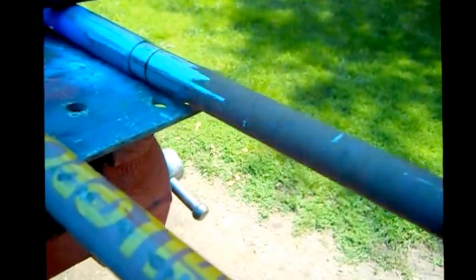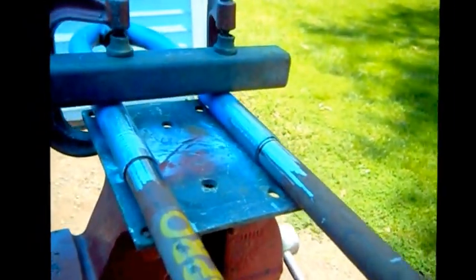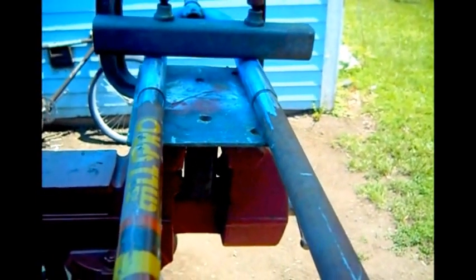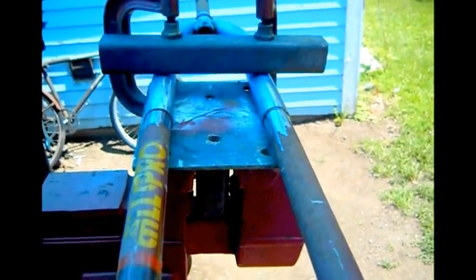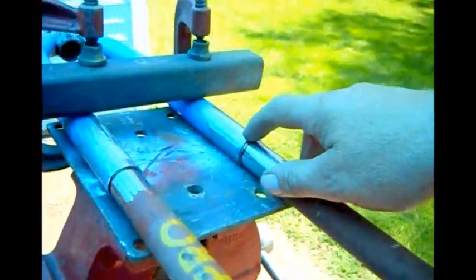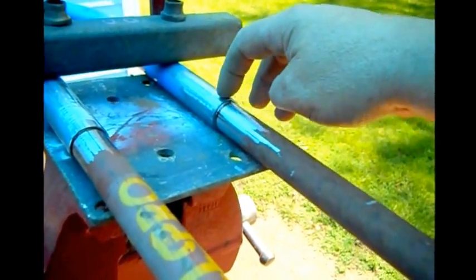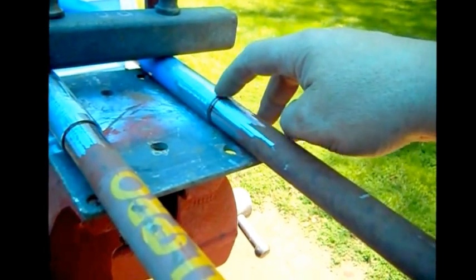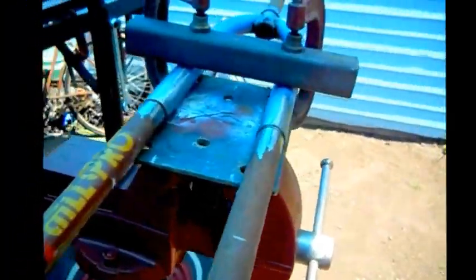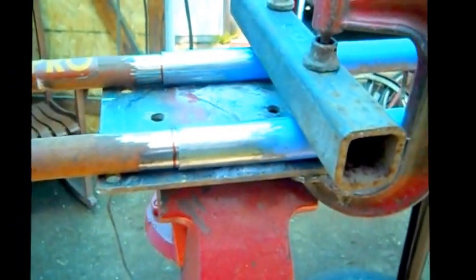These are only going to go an inch. I've got a little jig made here. This ain't perfect science, but they'll be eyeballed. I'll show a short clip when I put the wheel on before I braze those pieces on — I actually put the wheel on there, but just had to pound it in a little bit. These are going to be sweat brazed, meaning they'll be upside down once they're tacked. Then I'll be heating this and the brazing will suck in there, like when you see someone solder a copper water pipe.